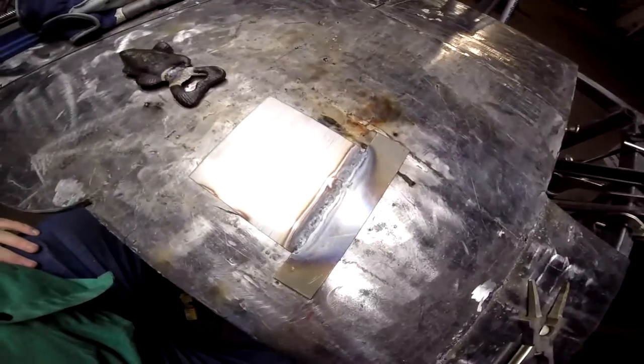As for the stainless to mild steel, it looks like it did a pretty solid job. But in this case there is a recommended filler for it — the 309L. I would choose that, just because there's a procedure and a recommendation. But I am in no way knocking this product. I think it's a fine product, and the job it did on the cast iron is incredible.